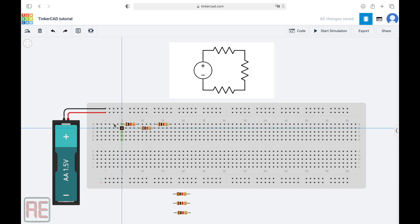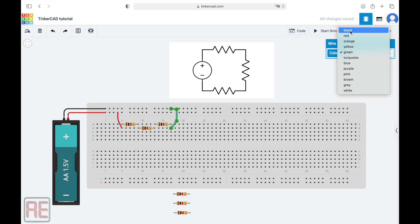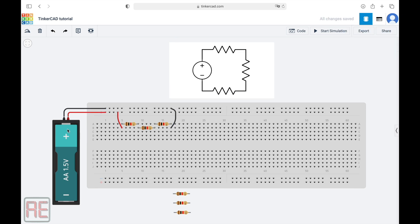To make the connection with the positive terminal, we just need to do this, and we're going to change its color to red. Note that one terminal of the battery is connected to terminal one of the first resistor, which is in series with the other two resistors. At this end of the circuit, we're going to make the connection with the negative terminal of the battery, and change the wire color to black. Let's have a look at what we've done: the positive terminal of the battery is connected here and is interconnected through all the points on this line. From this point, we're connecting the battery terminal to terminal one of the first resistor. The first resistor is connected in series with two other resistors, and then terminal two of the last resistor is connected to the negative terminal of the battery, closing the circuit loop.